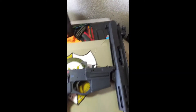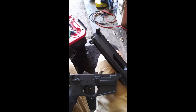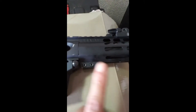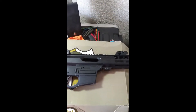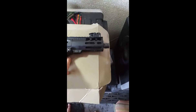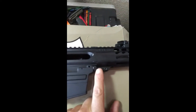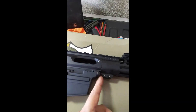The first problem was the gun would not open fully — I have pictures of it — it would only go about that far. They thought I might have installed the kit wrong and wanted to get it back to measure it. I have a 300 upper that I put on this and it folded down fine, so I thought it might have been the casting on the pivots. Some people say Spikes lowers are not the best quality, but if that were the case my 300 upper would have bound to the same spot.